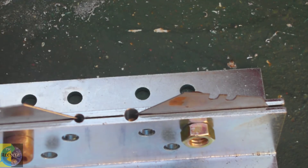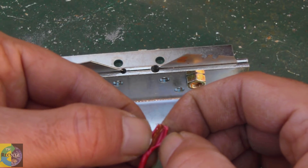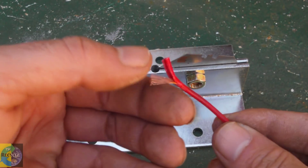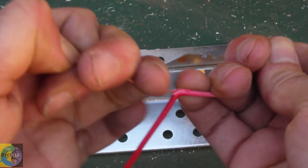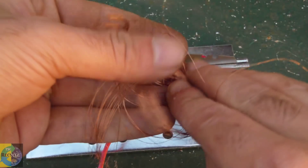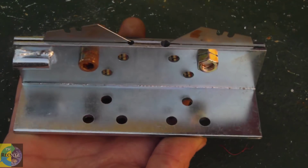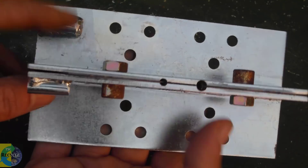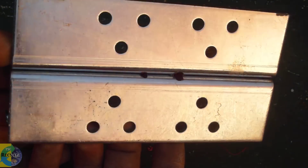So we initially hand tighten the bolts just to get the alignment right. Once you've found the right alignment, tighten that up and run a cable through — it should have a score mark which makes it easy to split the cable. Once you've found the right depth, tighten the bolts, make them secure, and that will last for a very long time. So there you have it — one stripper ready to go. You've got your holes in the top, 3.5mm and 5mm, and your two blades that score the sheath. Once they're clamped in, away you go.